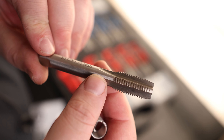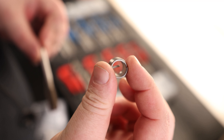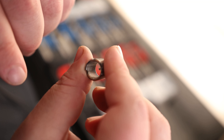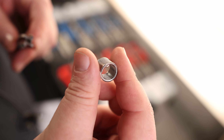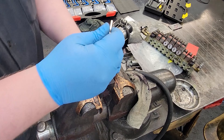These need to have something to actually thread into, so that is what this tap is for. This is a 12 by 1.75 high speed steel tap. You're going to need to drill a hole for this tap, tap that hole, and then insert the helicoil — and you'll have the smaller thread on the inside. So if you completely wreck the threads, you make a larger hole with larger size threads, throw this in, and then you'll have those threads restored.